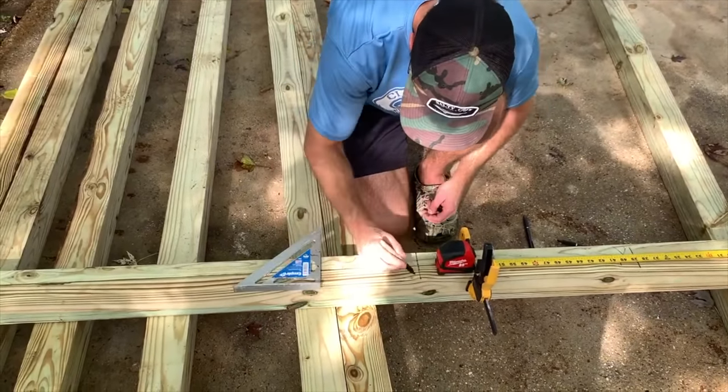After lifting all four of the shed walls into place and confirming that the walls are perfectly square, which is basically just indicating that you don't have it skewed either way and that each wall is perfectly plumb, what you're gonna wanna do is install the double top plate along the top of the walls, and that's gonna secure and tie all the walls together.